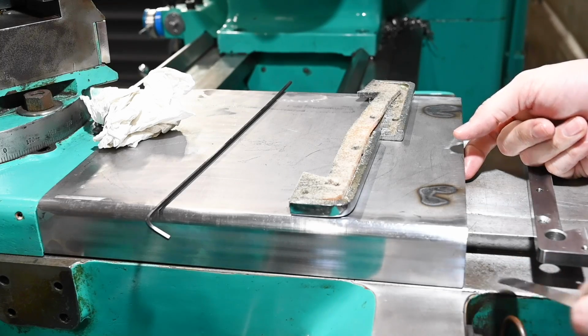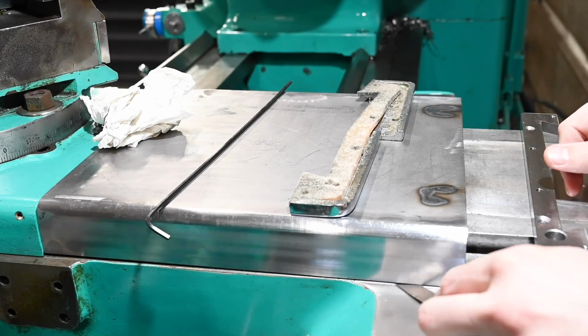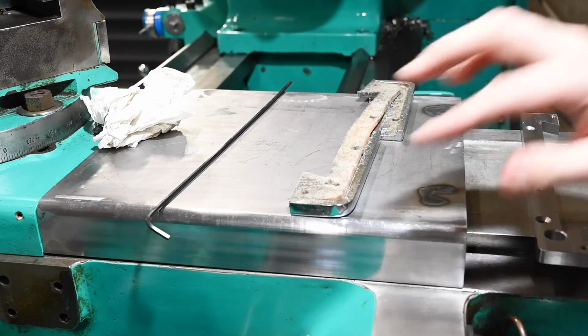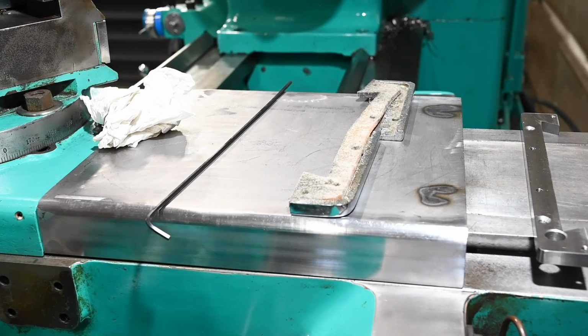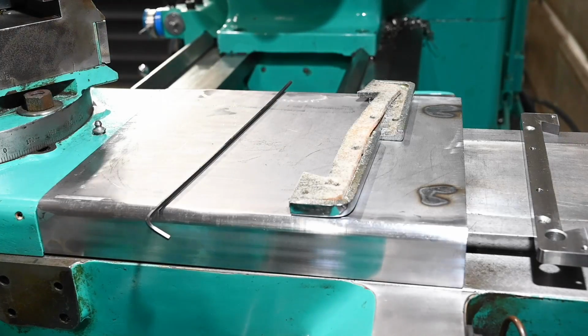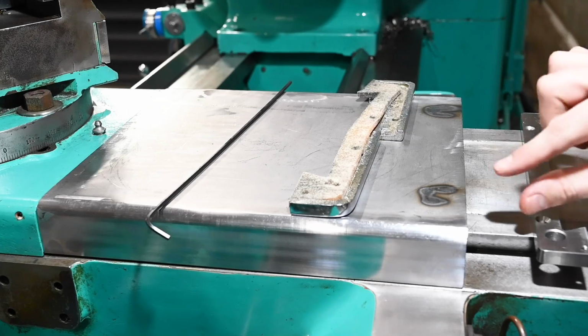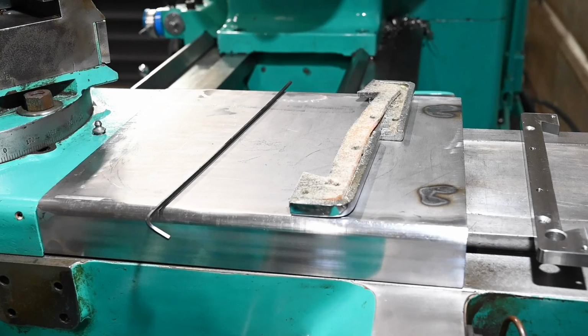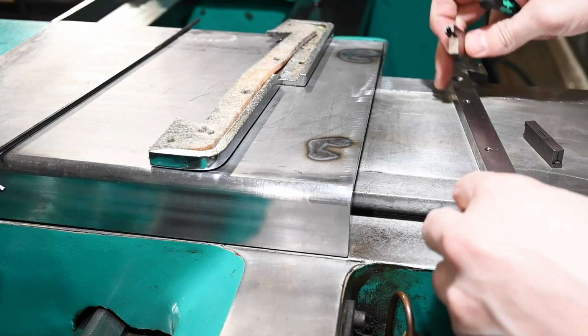This side, yeah, there's a little chip under there, but otherwise this side is holding up. I guess probably get some gauge blocks in here, or adjustable parallels, probably the smarter, easier way to do this. And use that to just jack this up just a tiny bit, and then that'll tell me what my full height needs to be for the Teflon.